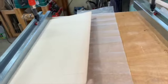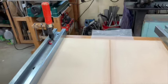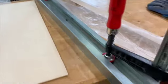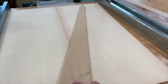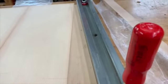I'm going to take the halves of my top, and having them all prepared, of course, jointed, and the edges made to fit properly, and we've put glue on them and rubbed that in and all. But the question now is, at what angle? Well, it's really easy. I make this tapered wedge. This one's out of beech. I've had it for years, use it again and again, and it's at an acute angle so that it will apply a force to that joint